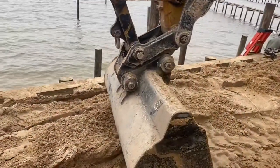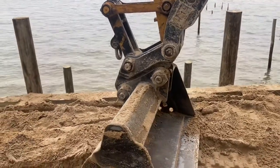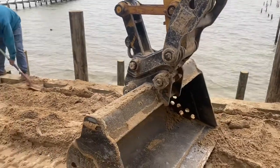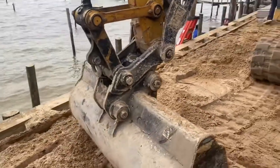Also with the manual quick connect coupler, it adds probably about 7 inches to the reach on the stick. But it's also 200 pounds, so you get a little bit more weight out there. So it has a tendency to make you teeter over a little bit quicker. You've got to really pay attention to it. But I think the trade-off is definitely worth it for what we do.